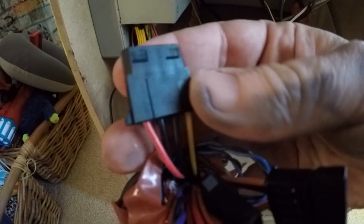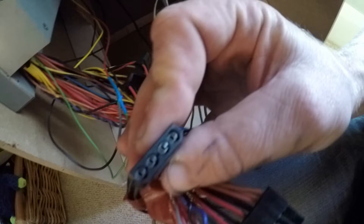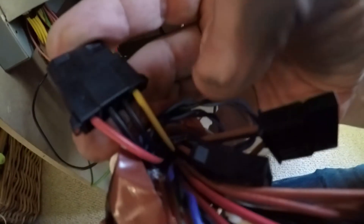Note that it has a red 12 volt wire, two black earth wires, and a yellow 5 volt wire. For my motor to turn at the correct speed I have to use the 12 volt power supply and one of the black earth wires. You can simply snip off this plastic plug and wire the red wire to one of the wires on the motor and the black wire to one of the wires on the motor.